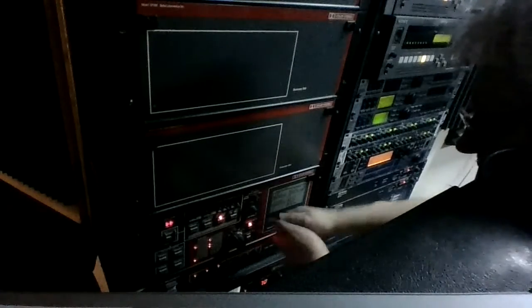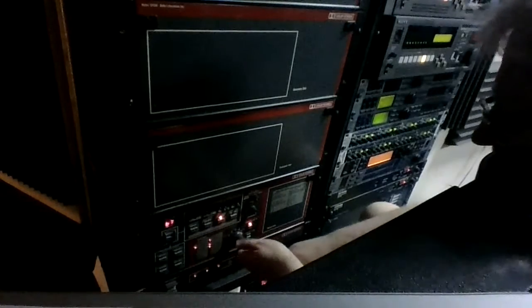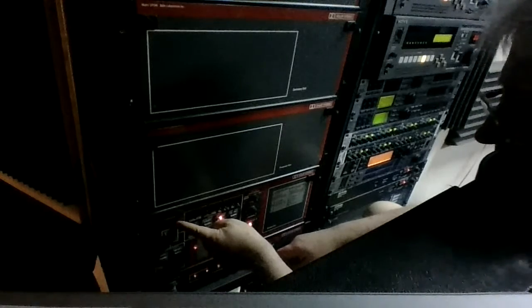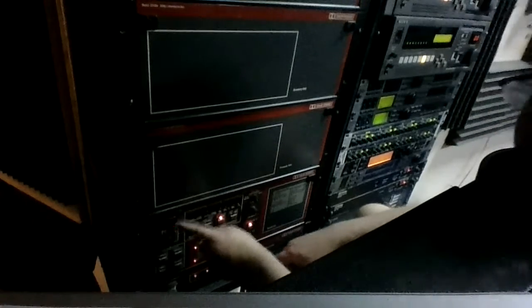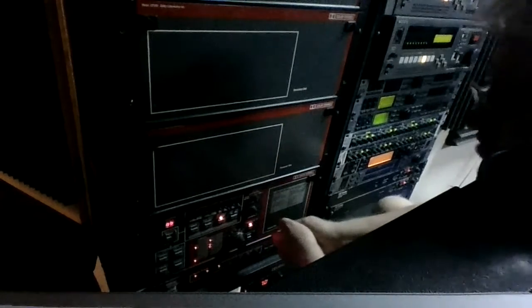So it's still flashing. So it's obviously the solder joint where I left it, maybe a wire, and it's only connecting here for the preset format. So if I go to here, format 67, and press go, there won't be any sound. There's nothing programmed into that format. I know that. But that indicator would flash if there wasn't a format programmed. If there was a format that's programmed in the processor, like if I go format 66, it should be static and showing 66. It shouldn't flash on and off. It shouldn't be blinking.